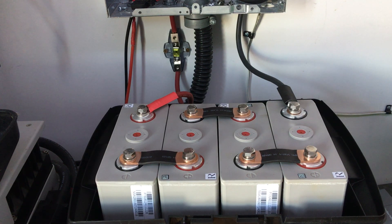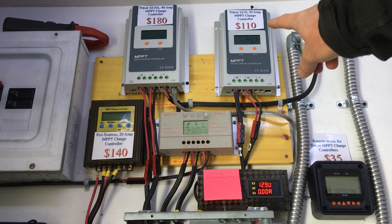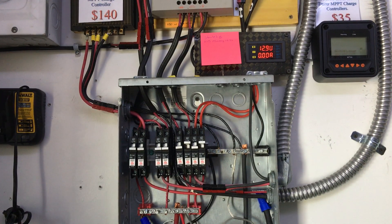So you need to make sure when you set up your solar system you have a charge controller that you can manually input the maximum charging voltage and a few other parameters. A lot of the controllers these days will do it, including these right up here that I sell — these are kind of my go-to inexpensive MPPTs. If you have the meter, it's going to give you the ability to program a lot.